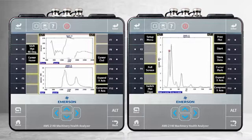While this is the traditional approach to resonance detection, it requires phase data. If phase is not available but you are still able to collect data during the coast down of a machine, you can only expect to have a plot like this one of your vibration measurements.